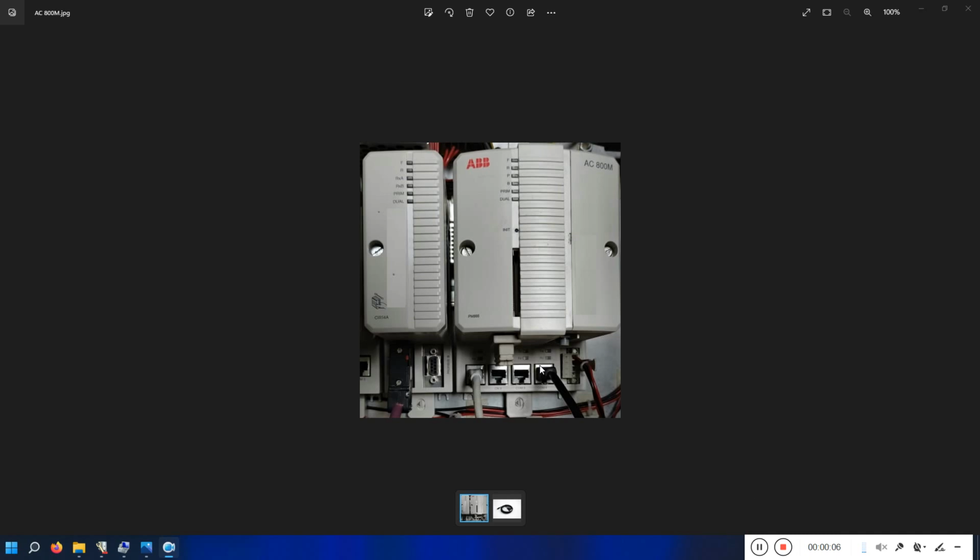So today I have got an AC800M ABB PLC, and this will be a short video. I'll be explaining how we can set the IP address, read the IP address, and a small simple program to download and go online with this PLC. So this is basically a video about how to start up this PLC.